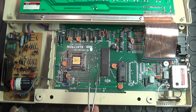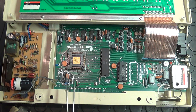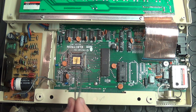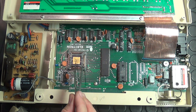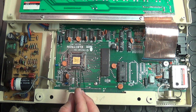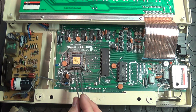The Electron is taken apart and you can see I've exposed the internals. The problem chip is the ULA. What Acorn originally did in order to bring the costs down was get Ferranti to create this all-in-one ULA chip, which was great for cost reduction but unfortunately it runs very, very hot. Doing a little bit of research online, I found that this is a common problem with Electrons.